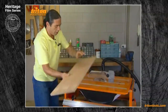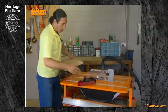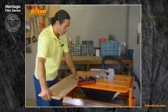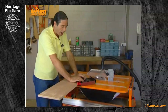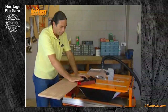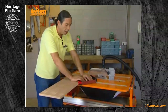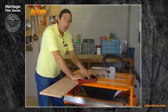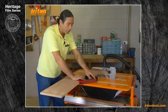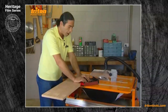The easy fix is to turn the protractor around and start off like so. It's important that you hold the work down on the table, hold it firmly to the sandpaper face, and keep pressure downwards on the protractor. That's how you get the most accuracy — pushing downwards engages V-grooves at the bottom of the track with V-grooves on the protractor sliding strip.